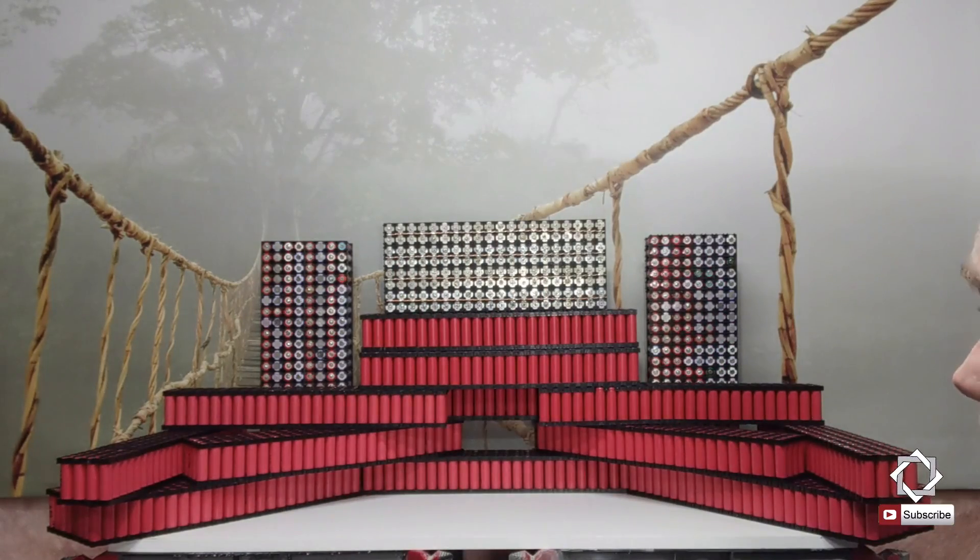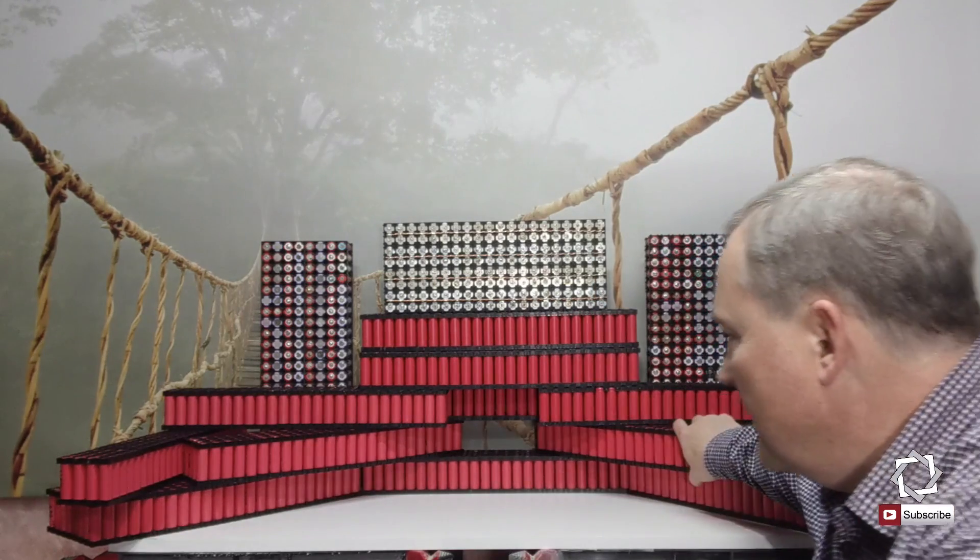Take a look here — I got this on a deal. In that process, I've gotten all of these for under two grand. I'm less than $2,000 in batteries, and I did that because I looked for deals. I went out and hunted and found. I grabbed laptop batteries, tore them apart, re-skinned them. All of these red cells are brand new and I got them for less than a buck a cell. You can find those deals but you've got to look for them. And when I want to grow my Powerwall, it's going to take more cells — I'll probably spend a buck, buck and a quarter. I don't like going over $1.25 for cells.